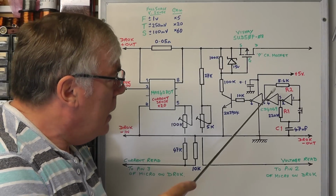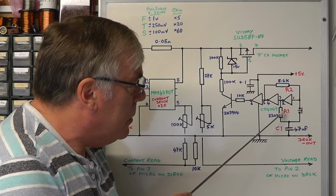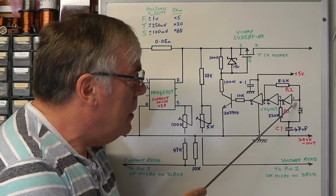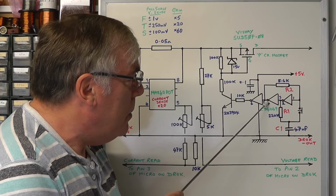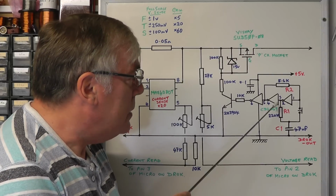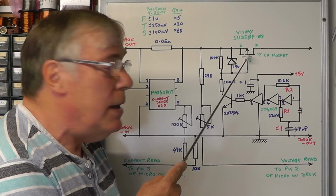So what we have now is the little bistable locked into that state where pin 1 is low, but the capacitor has now been charging through the R1 resistor because that point is high. So the next time we press the little button, the positive charge on that capacitor is fed to pin 1, which takes that high. As soon as that goes high, the output goes low. That output low means this output here is high, and you again get positive feedback with that resistor R2 enforcing the high voltage on pin 1 and locking it into that state. So that's high, that goes low, the transistor now turns off again, removing the connection from the gate to ground, and the MOSFET turns off.